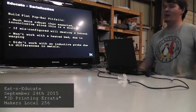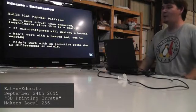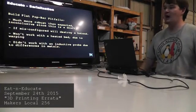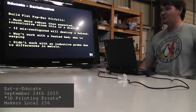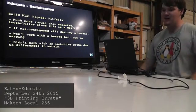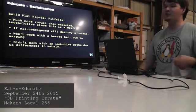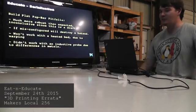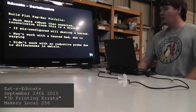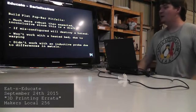And at that point, I kind of gave up on this as an idea, because I think that it is also viable, but only if someone with more resources or time or skill than I built it. You have to have it be absolutely flush with the print bed. When the lever is down, it has to actually sit completely flush. Otherwise, the hot end will ding into it every time it passes past it, thus deforming your 0.4 millimeter aperture, which is pretty easy to do on brass hot ends. So I think it could work.